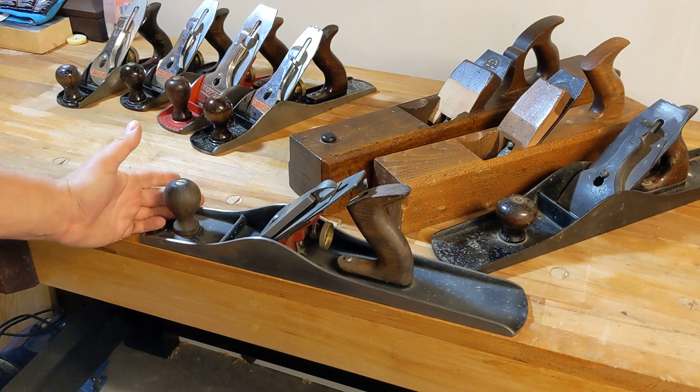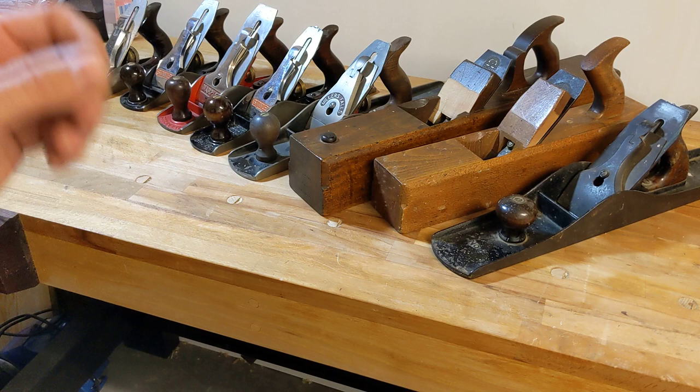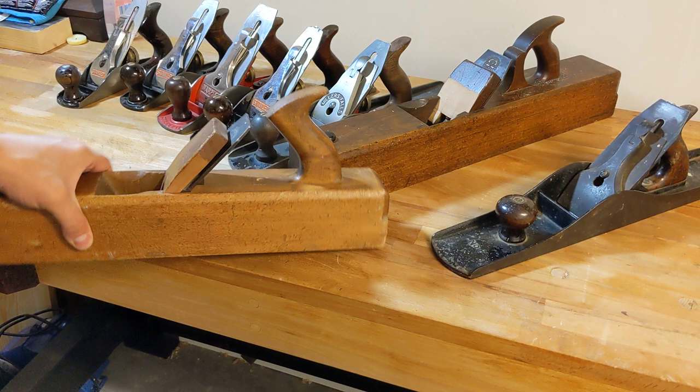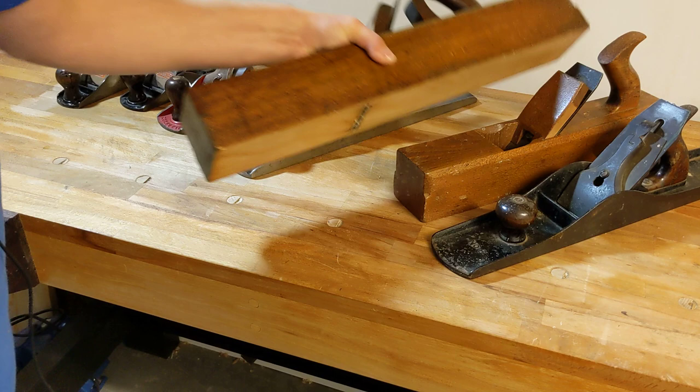You want to start processing rough boards seriously. You want to maybe get into that whole hand tool purist thing. A jack plane, decent British jack plane, that kind of pattern, absolutely fantastic. You might take your little time to tune it up and get it right, but it's going to be a godsend. And then lastly, if you're going to finish up processing your timber by hand, you're going to want a wooden trying plane. That's going to do you well.